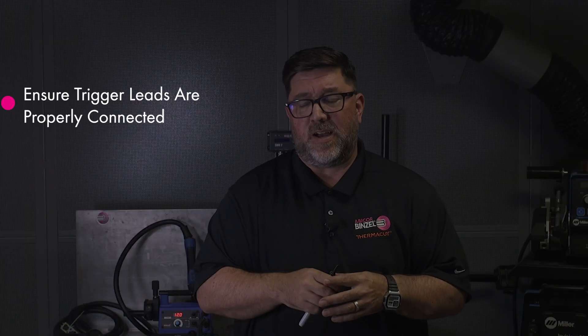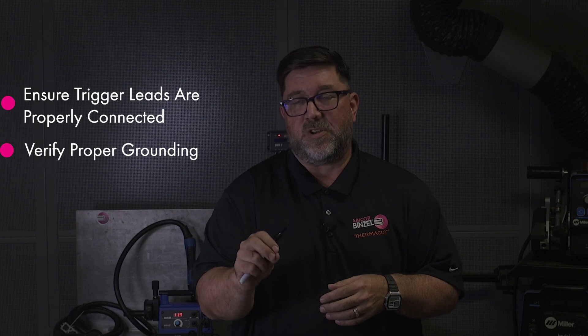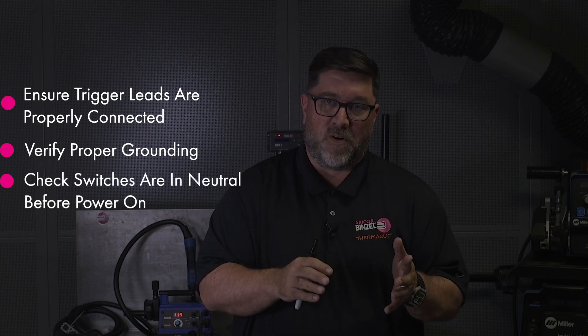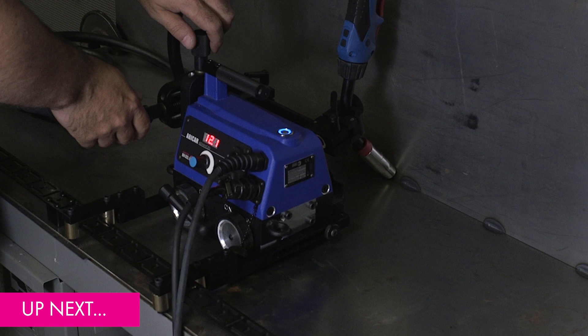As you can see, it's pretty straightforward. In this application we're using a continuous weld with a rigid backstop that guides the Abicor along its path. But there are a couple of things to think about if you're having issues. First, check the trigger lead — that's actually happened to me in the field a few times, so it's a great place to start. The second is maybe bad grounding. Also make sure those switches are in neutral before you power the unit on, as that can throw a fault. You can find all this information on our website — please feel free to reach out to our team with any questions about the Abicor; we'd be happy to help. In the next video, instead of the rigid backstop, we're going to use a flexible guide rail and show you how to install that and some of the benefits of using it. Thanks, we'll see you next time.